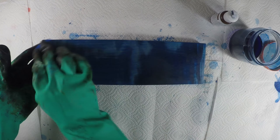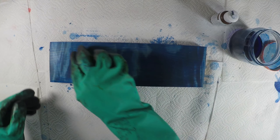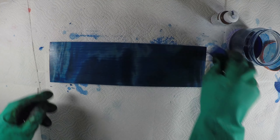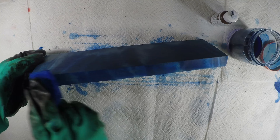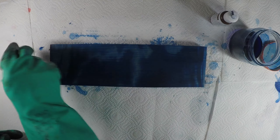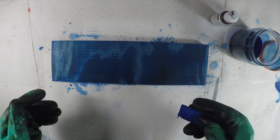I don't know if this is going to really pick up any more dye. It gets to a certain point — a saturation point — where it's like a wet towel, the wood fibers can only take so much at once. Just let it dry as well. When this dries out and if you want it even darker, just let it dry out and go over it with a second coat. With the second coat you shouldn't have to go nearly as heavy or as long, but that initial contact with the dye and the wood surface is where you want to work it around a little more.